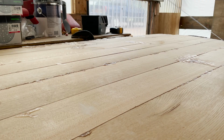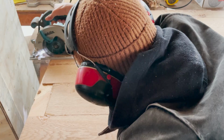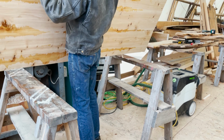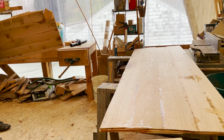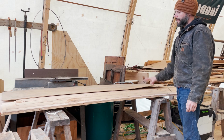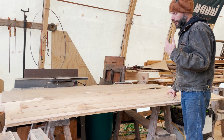And I pulled out the last piece of homemade plywood and zipped it in half and got it upstairs. So we can pull the pattern out, lay it on there, and see if we can create a bunk. Here's my pattern board and the two pieces of ply. So this one, we're gonna go stick off to the side, and this is going to become the other part of the head. So the panel that runs fore and aft and has the door in it.